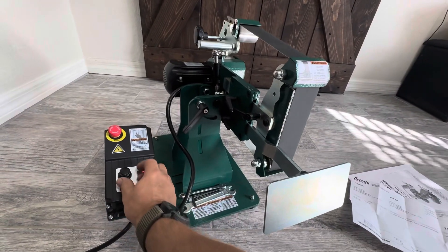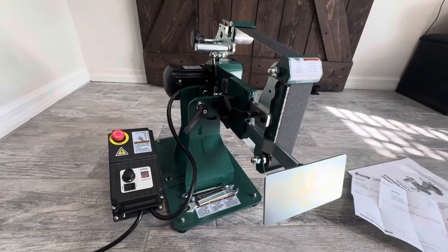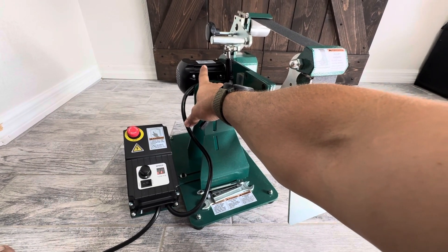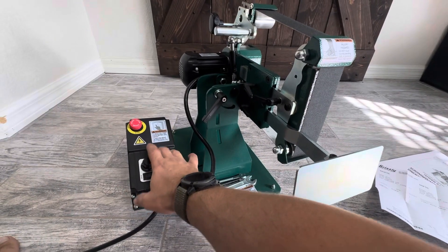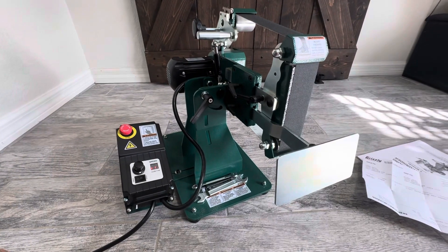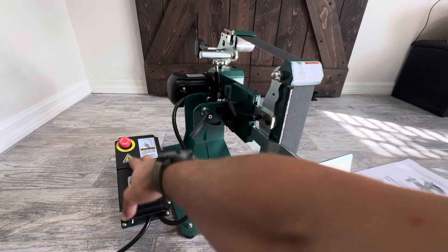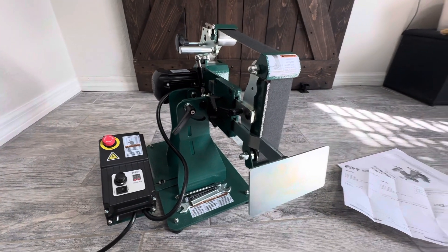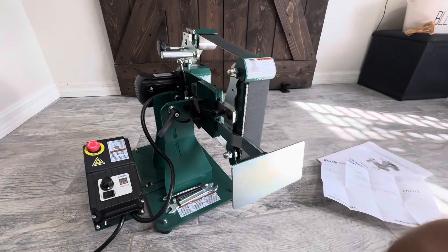It can go really slow or really fast — I think it says 100 to 5000 RPM for the motor. So it's got to be a different system, because this is a very small motor for three-quarter horsepower. I have three-quarter horsepower single-phase motors on my grinders and it's different. This isn't your typical variable speed or typical motor you find on grinders. None of my grinders are variable speed anymore because I keep killing everything with the amount of water I use, so I went with single-phase slower speed motors. But once I do this conversion, this is going to be a really nice little machine for really cheap to get pretty much any job imaginable done as a knife maker.